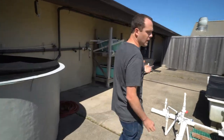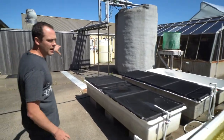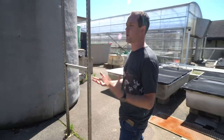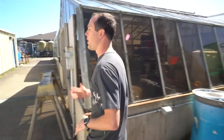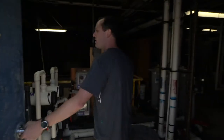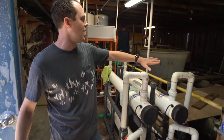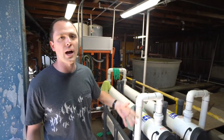Here we just have more seawater tanks. This whole side of the courtyard drains into a quarantine system which then flows into that facility there and is completely sterilized before being released to the bay. So if we need to bring in animals from anywhere other than Yaquina Bay, we want to make sure we're not spreading pathogens where they shouldn't be. This is the chlorine shack where all the sterilization goes for the quarantine side — we have the capacity to UV the seawater if needed, but all of it flows through and gets chlorinated, then neutralized before being released to the bay.